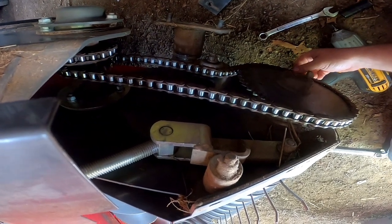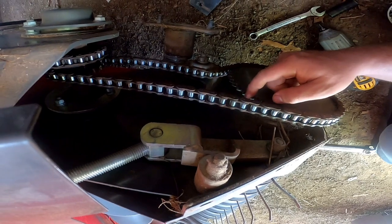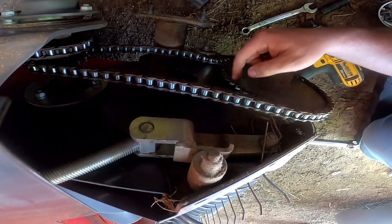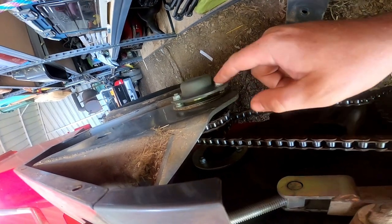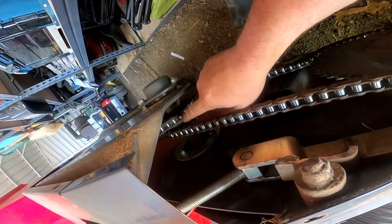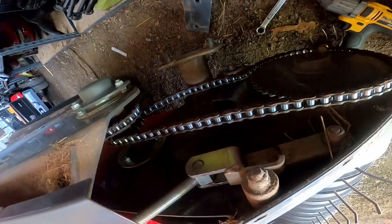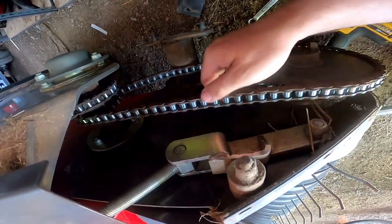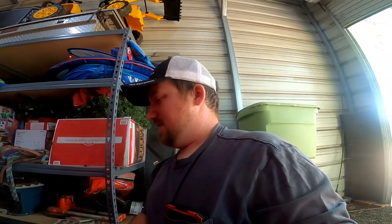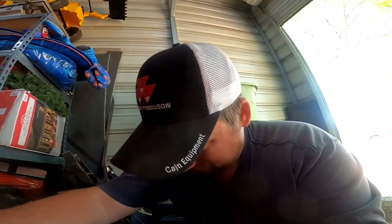The cheap part of me says take a link out, but I know what happens if I take a link out when this thing's completely out of play. They used to have a lot of play travel, and what'll happen is it'll wear these teeth off — then I have to buy this sprocket and that sprocket, and all this has to come off, and chances are I'll have to replace that bearing too. So yeah, I might be out all that money rather than just paying for a cheap number 50 chain. It's not that it's cheap, but it's cheaper than all that other stuff — that's the dilemma.